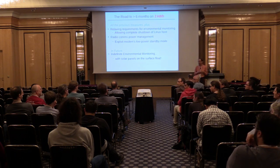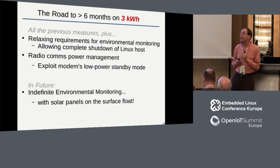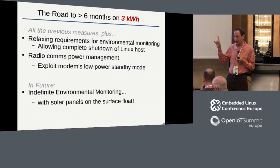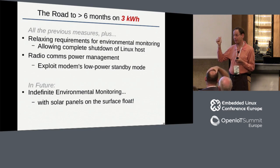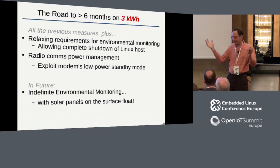Question: Why did you choose RS-422 rather than another protocol? When we tried the system with RS-422, the problem is it needs a lot of conductors - it uses two conductors for every one that RS-232 uses because it's differential signaling. We only had six lines available, and with the handshakes needed for the modem, we just ran out of conductors. Also, the University of Washington liked the USB idea or a network because they could then add additional devices on the float - with RS-422 it's pretty closed and you can't just throw another device on there.